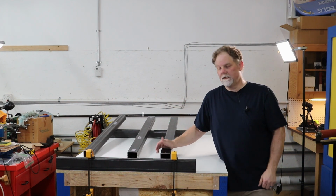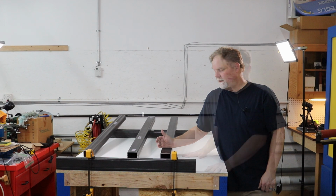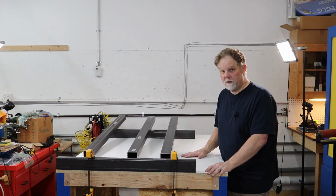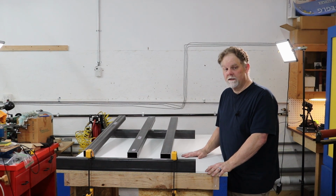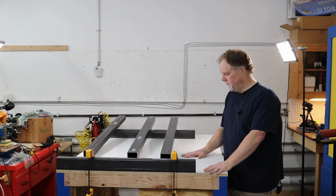You nailed it. I need to point out that the instructions for the X-axis frame prep in the wiki do in fact tell you to flip the steel over and drill holes on the opposite face. I was in a hurry and I missed that portion of the instructions. I've since edited that step in the wiki in order to make it harder to miss. The screw is only supposed to be 12 millimeters long, not 16. It's a mistake in the wiki and it probably has been corrected already.